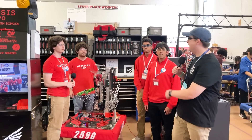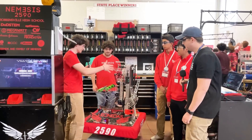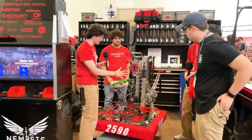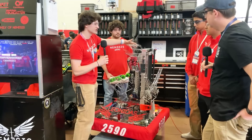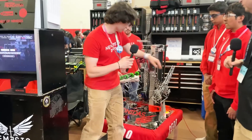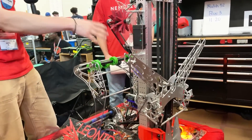I'm here with Artie, Ben, and Jeevan. Artie, why don't you start us off? I'm gonna start us off with our mailbox end effector and our elevator. This year, we chose to do a side-to-side mailbox. It intakes from the source and our elevator is belted together — it's a continuous belt loop elevator that has a carriage in the center which the arm sits on.